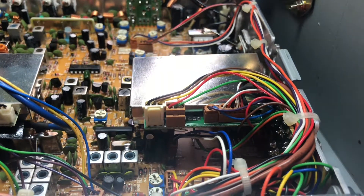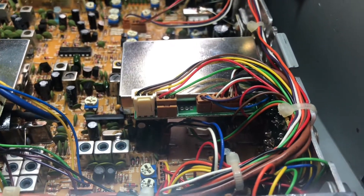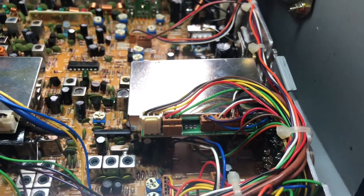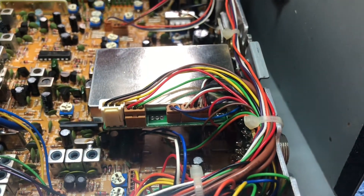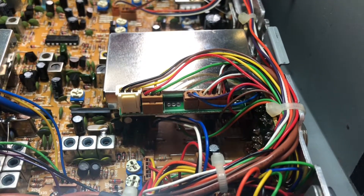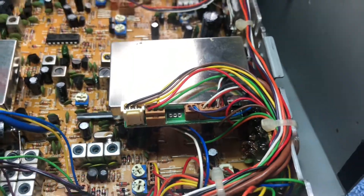The crispness of that frequency — I'm going to add a capacitor in line. It's that simple. It's basically just this little part right here. Once you put that in place, the sizzle goes away — that's basically what a high cut filter is. I'm going to show you the before and after difference and the process of putting this in, just to show you that you can do this to any radio that's having issues or doesn't have a high cut filter and is real noisy.